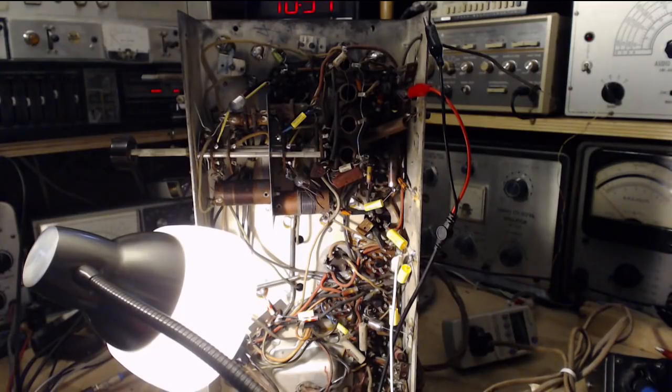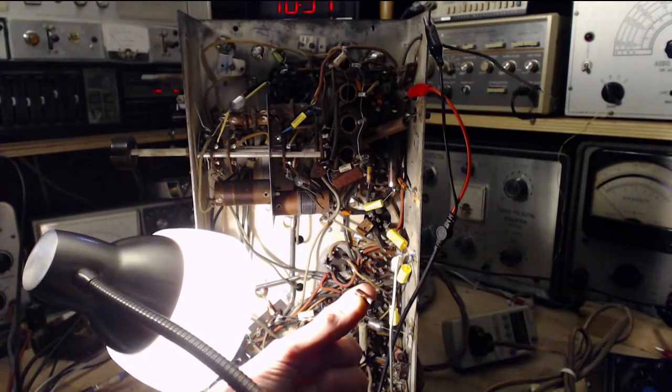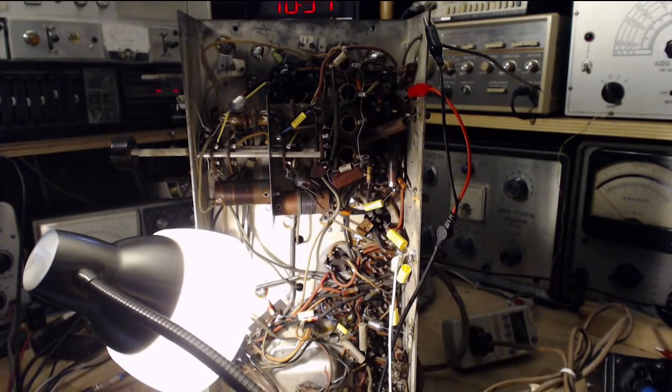So body, end, dot with a silver band. So red body, end is also red. That's the funny thing about these kinds of resistors. If the same color occurs twice, you can't really tell. So red, yellow. That's it. 220K. Okay, and kind of a regular size resistor.